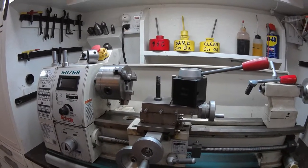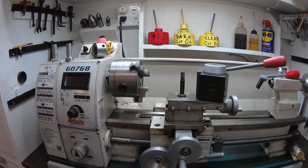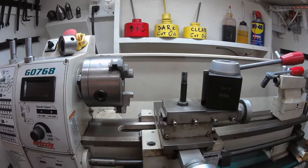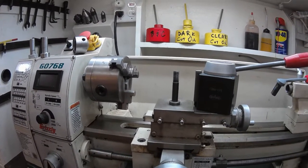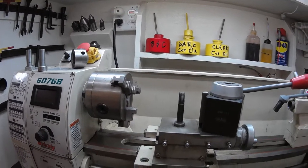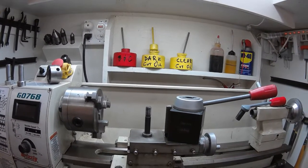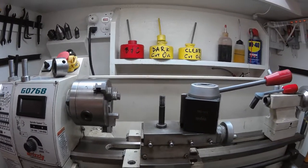The AXA size fits onto the lathe and allows the centerline. But the difference between most of these small lathes is the top of the compound. In this case, the compound has a little boss that holds the head of the stud. It's a metric stud that rises up and it's tall enough for the four-way tool post, but it's not tall enough to get over top of the quick change. Some people have done different methods — removing the stud, putting a larger one, putting washers.